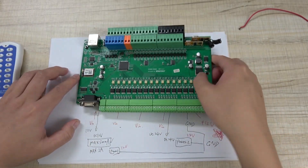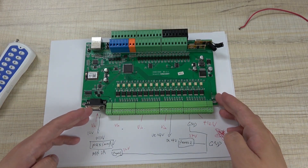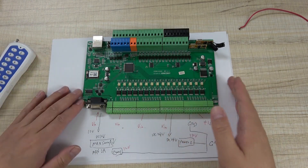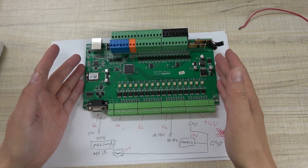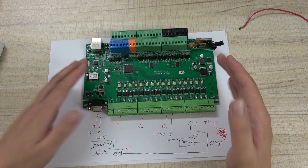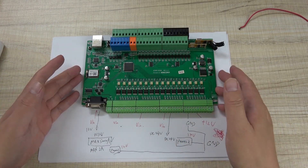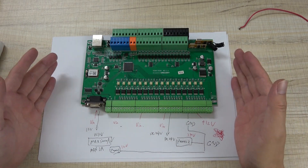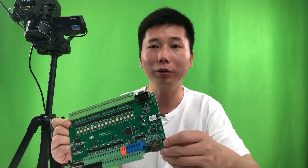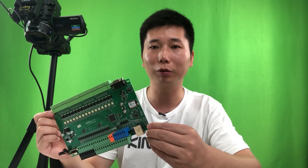So this covers the details of the output, input, wireless, network, Wi-Fi, RS-232, and RS-485 interfaces. We have designed the Wi-Fi module and Ethernet module both connected to the CPU, so you can connect the board to the internet with a cloud server and also work on a local network at the same time. These two modules always work simultaneously with the MCU — so this controller can work without internet and with internet at the same time. This is the hardware overview of the H32BS. If you have any questions, leave a message and we will respond quickly. In the next video I will show you the network configuration and software setup. Thanks for watching.